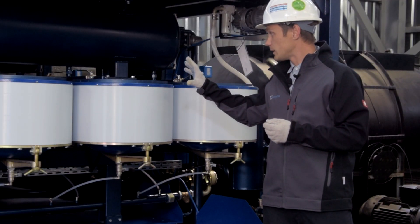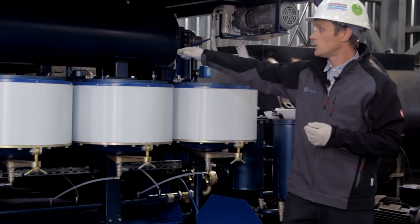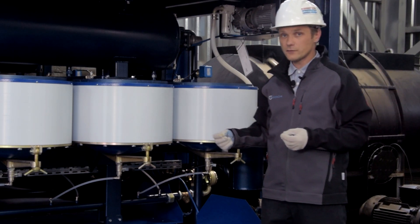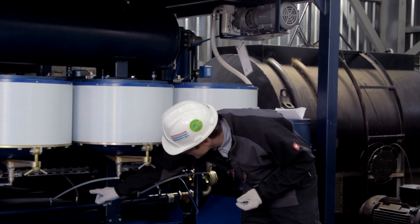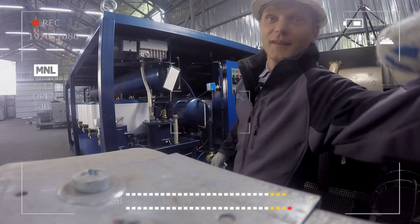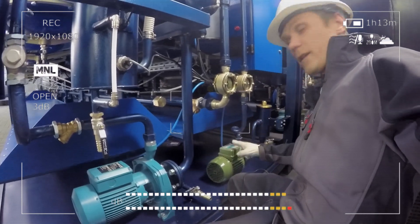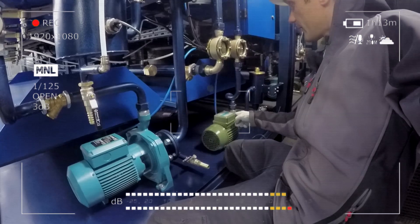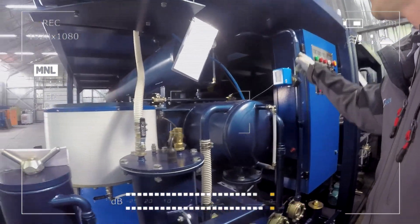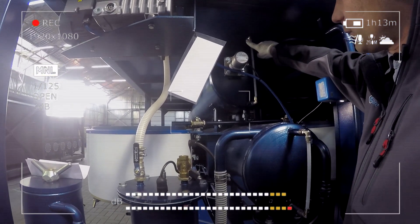To do this, we place the sorbent into this module first, and after that we put the oil in. Oil coming through the volume of the sorbent is regenerated, and then we collect it and pass it out from the machine. It's quite simple. We take oil with the inlet pump, through the mesh filter, then oil is passed through the sight glass, through the flow sensor, into the vessel for dirty oil, which has a level pipe and level sensor.